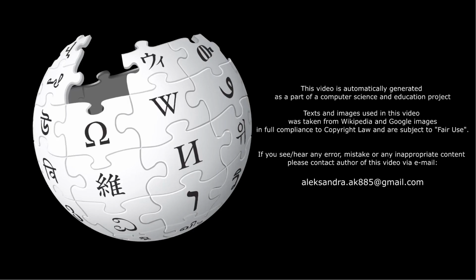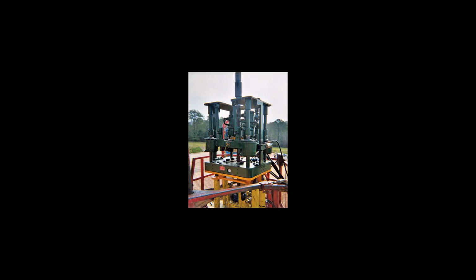Another popular method of stripping tubulars in and out of a well bore is with the use of an annular blowout preventer, BOP. An annular BOP consists of a natural or synthetic rubber element with encased metal reinforcement sections. A hydraulic piston pushes the annular element up into a concaved cap which forces the element diameter to decrease in size. When the element diameter is closed sufficiently, it forms a seal around the body of the pipe.